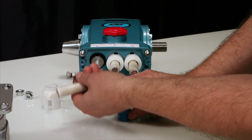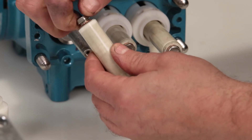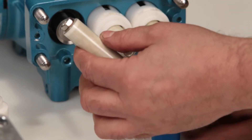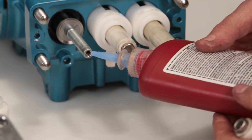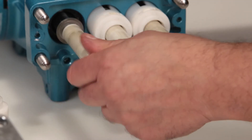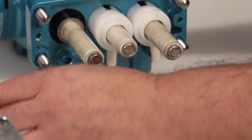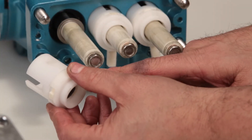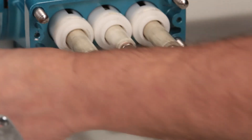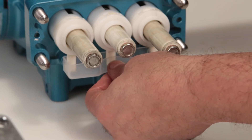Add a lubricant before reinstalling. The plunger retainer can only be installed on one side of the plunger and should fit tight into the end of the plunger. Before installing the plunger assembly, apply thread sealant on the end of the plunger rod. Install the plunger assembly and tighten using a 12mm wrench, torque to specification. Next install the plunger retainer with the long tail of the wick facing down. The oil pan has two tabs that rest in the crankcase — with the tabs sitting inside of the oil pan, press into place.